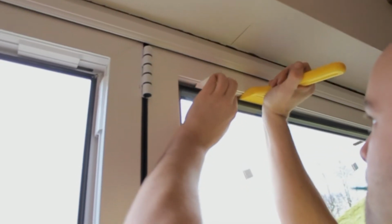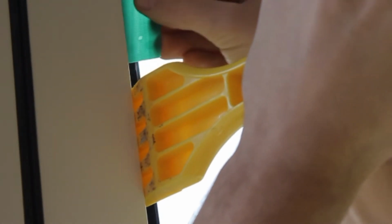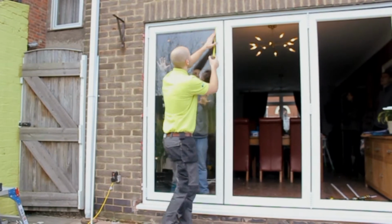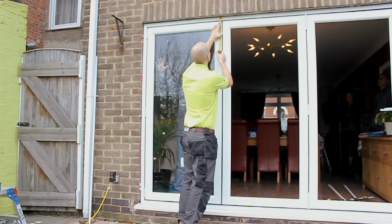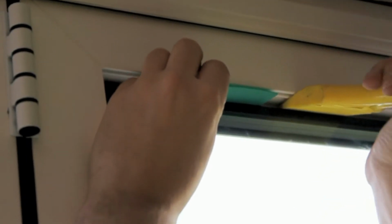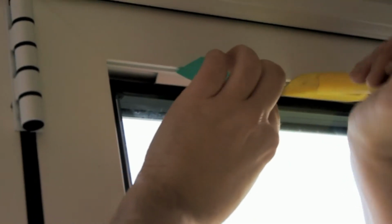All sashes should be toe and heeled to maintain equal and parallel gaps on the head and the threshold. A full toe and heeling guide can be found within Liniar's bifolding door installation guide. Add silicone between each vertical platform to help keep them in place.